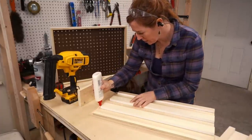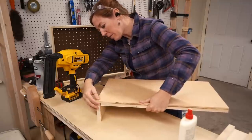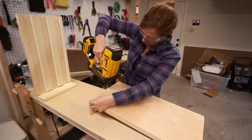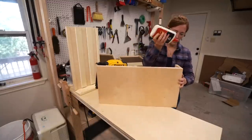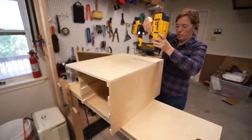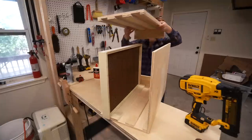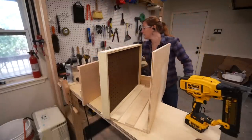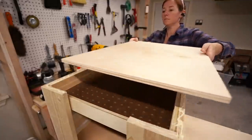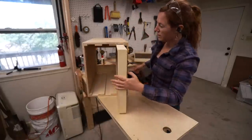Going to the back, I apply some wood glue and nail some one-by boards into place to make a box out of the entire unit. Then I put on the sides — turning the whole unit up on end, lining each side up flush, and brad nailing it into place. I use a second side to prop it up while nailing, and use a tray in place as a holding shelf when attaching the second side. Working with gravity on its back for the last side, now I have a complete box with sliding components.